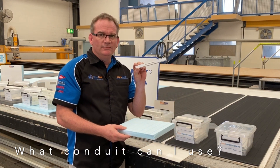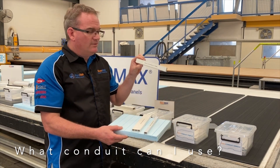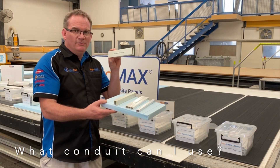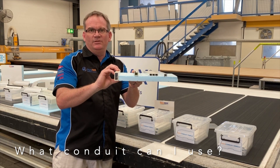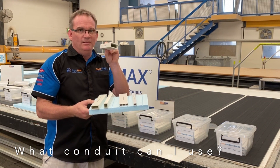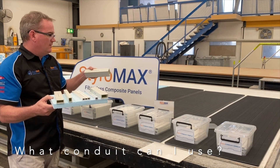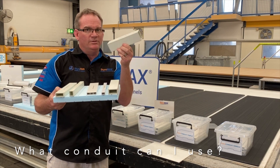You can certainly put a conduit single inside a 25mm core — that will fit. The triple will fit. You can use the conduit small 20 by 25 — that will fit one way, or you can tip it on its side and use it the other way. Conduit Large, the 40 by 20, you can only lay flat; it will not work on its edge as it's too high for the styrene core. Styro-Beam LT can also be used, but again only flat — it can't be tipped over because it's too high. Styro-Beam XHD you cannot use at all; it is too big and you'll require a thicker core to use that beam.